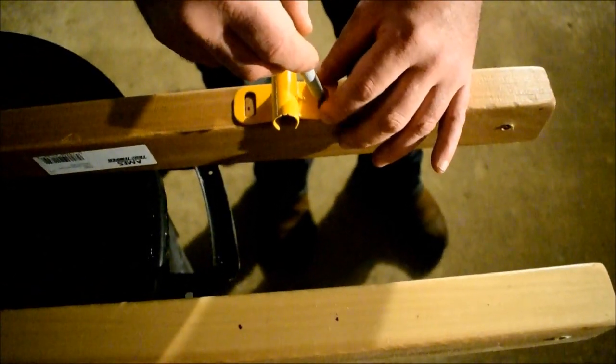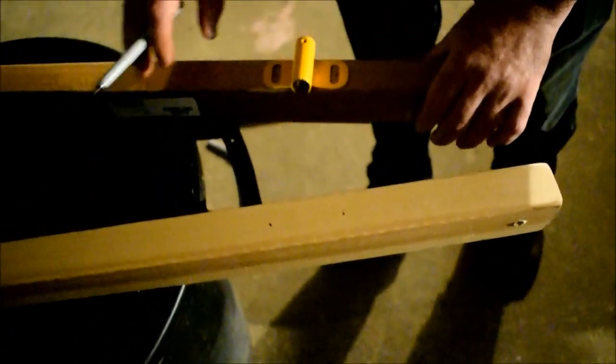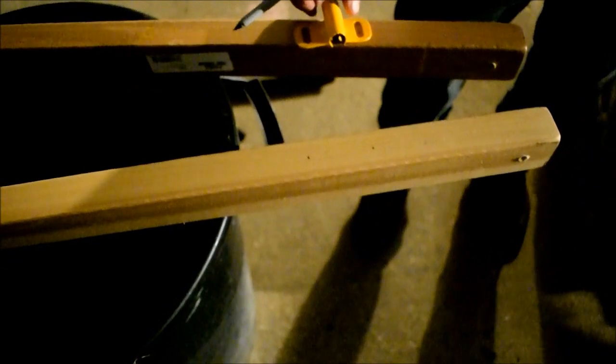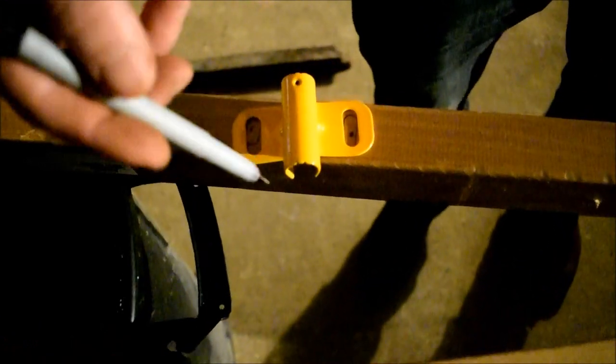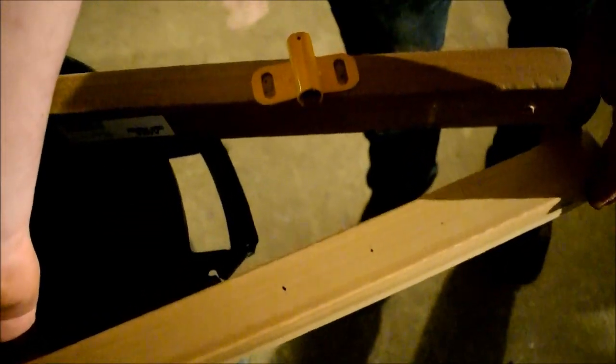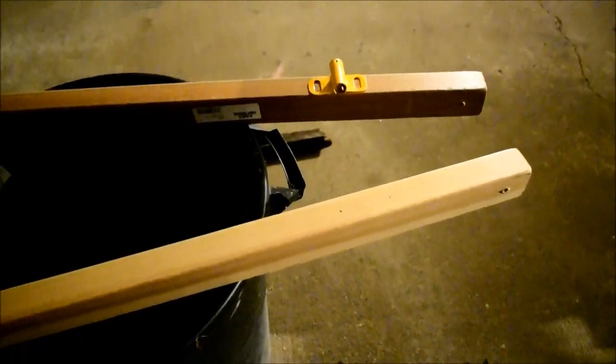Use your best judgment, because these are adjustable. If you get any of these measurements off, you'd have one handle forward versus the other. Correct. You'd have a dog walking, single-wheeled wheelbarrow. Obviously these handles will be like that, and you can't have your plate like that. True. Because your axle is going to be twisted ever so slightly, and that's what these slot adjustments are for, so that your axle is straight when you're V'd out like that and you've got a front nose piece. Something in that realm. Make sense? Yeah. So you've got your second one on there, and that's what you're going to do again.